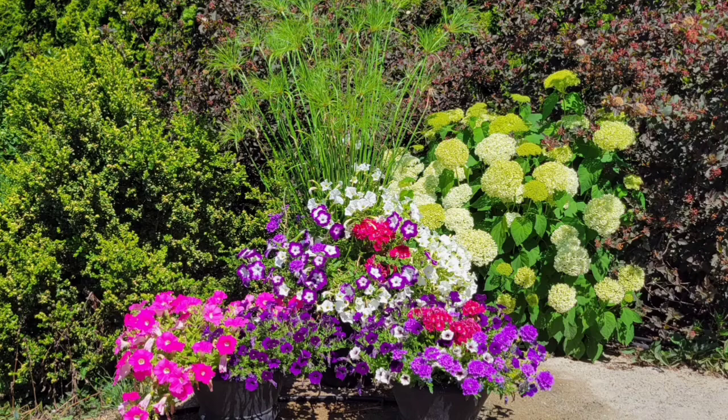In a perfect world those cans would all fill up with exactly the same amount of water — that means you have a beautiful, even irrigation system with an even precipitation rate, applying water evenly over the whole surface. The amount of water is the next factor. If there's only an eighth of an inch in the cans and you're supposed to apply half an inch, you need to increase your run time — double it if you had a quarter inch.